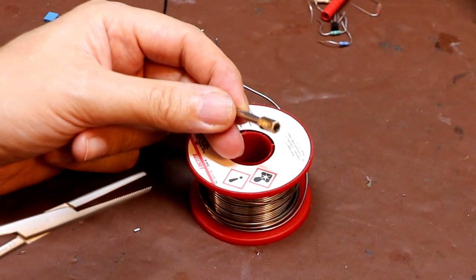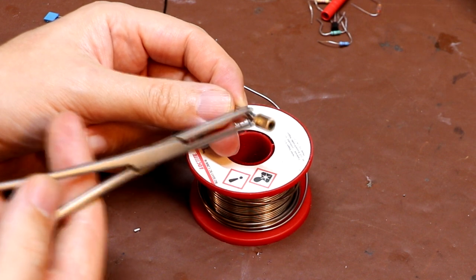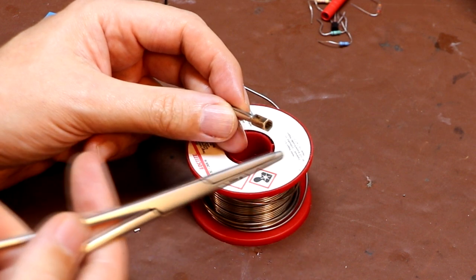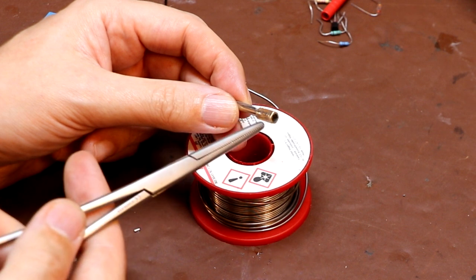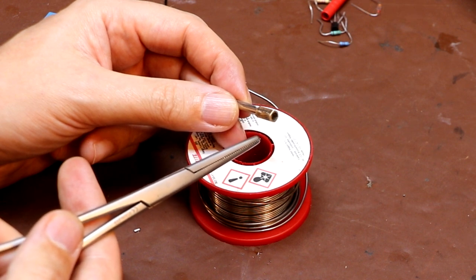Well, as you can probably see, I've just been in the garage and taken our 4mm banana plug and cut the back end off it, because normally these are designed to be stackable, so that you can install another banana plug and join one connector lead to the other. But I don't need that, and having that extra material on the back just means that everything is a little bit bigger, and I was conscious of wanting to keep the size down.